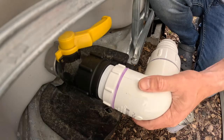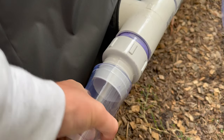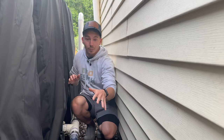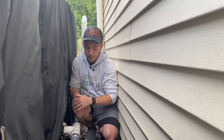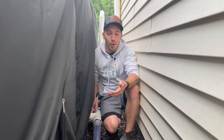At the end of the day, they're all connecting to two inch threaded PVC, which then allows me to connect it to the rest of the system. You've probably noticed the clear tubing connecting all of my IBC totes together. The reason I did this is because I expect these three totes to settle to some degree on their own platform. After they get full with 275 gallons of water each, that's a couple tons of water — a lot of weight. So I'm expecting each one of them to settle individually. This flexible tubing allows the totes to settle without putting a lot of stress on the connections. If I hard-piped this all together, it would stress the joints and you'd probably develop leaks or even crack your PVC.